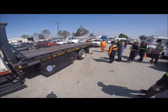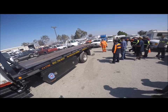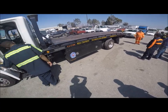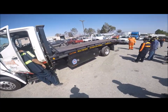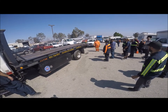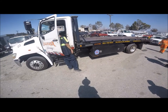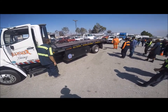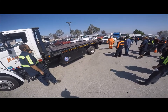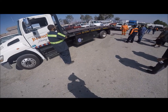What do you think this truck weighs? 17,200 pounds. That's pretty close — probably right around 17,500. I have one that weighs 17,500; we've got one that weighs 17,200 up to 17,500. How much do you think is on the front axle? About 40% — about 7,000 on the front and about 10,500 in the back. So if we weigh 17,500, what's our gross vehicle weight rating? 25,500.